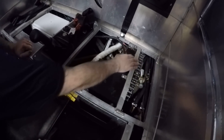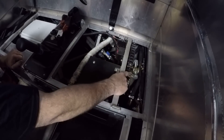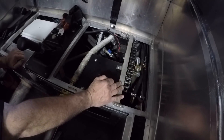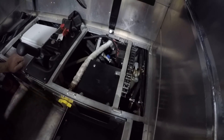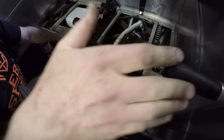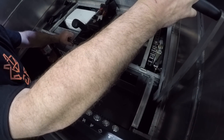Over here is the chain. There's an adjuster to take the slack out if you need to. It comes with a tool kit and all the tools to make all these adjustments are in that kit. You got your levers to steer here left or right. You pull them both back — it puts it in neutral, and that is your brake as well.